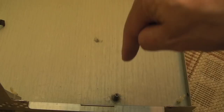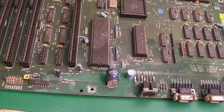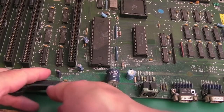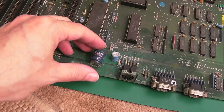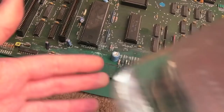There was one screw going through the mouse port holding it into the chassis, and one through the floppy drive port. Now that we've got the board out, I'm going to remove the battery — I'll snip it off carefully. I can always desolder the points from underneath. The only problem doing it this way is I might mangle the pads. There we go — it's pretty much free. The battery is off.